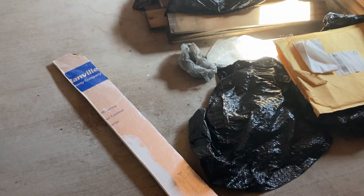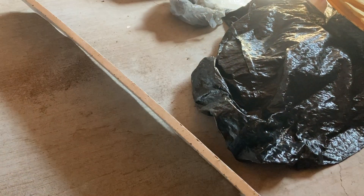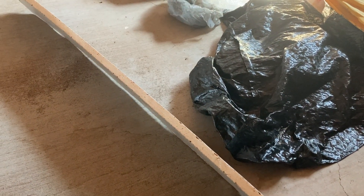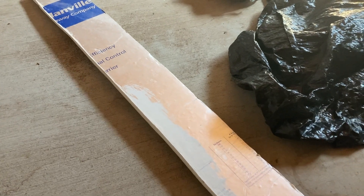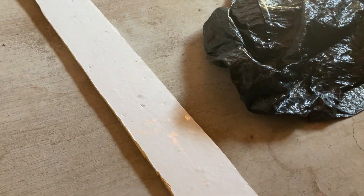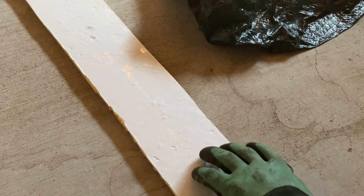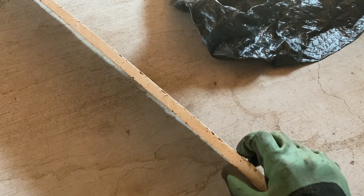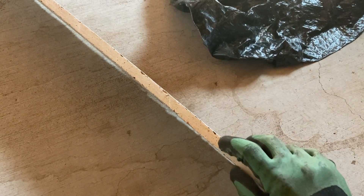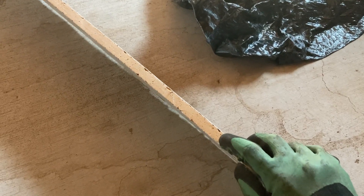So now let's talk about what insulation really is and how I got here. Over here I've got a strip of polyisocyanurate — this is a very good insulator. On one side we've got this foil face, which is a radiant barrier and a water barrier. On the other side we've got this plastic membrane, which is just a water barrier because you really don't want this stuff to get wet. And then in the center here we've got the actual polyiso, the foam — that is the insulation.